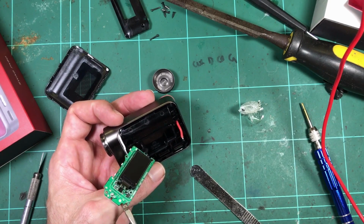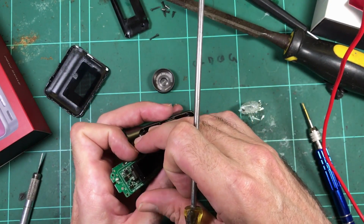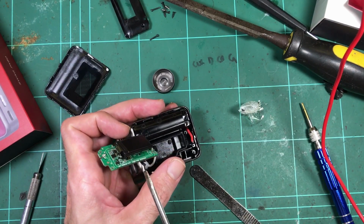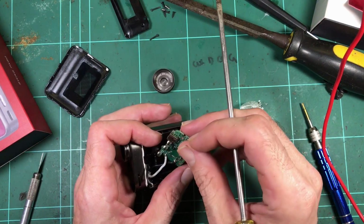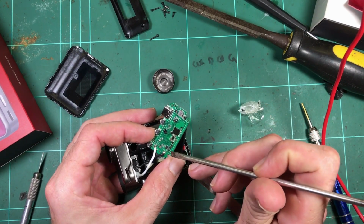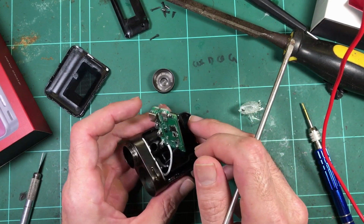So there'll be a few bits and pieces to run him and set a few things. Often these charging controllers, you can set what current you want them to run at with external resistors, and often they'll need little bypass caps and a few other things like that in the circuit. But yeah, there's no main inductor.